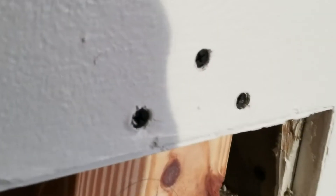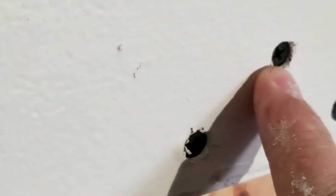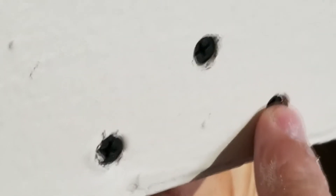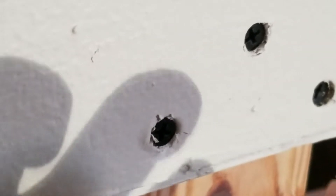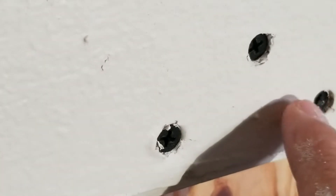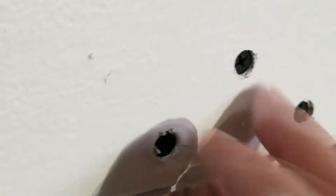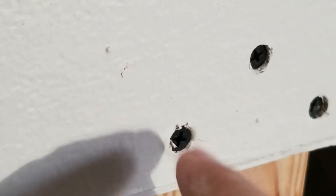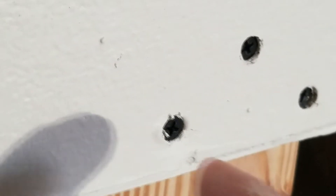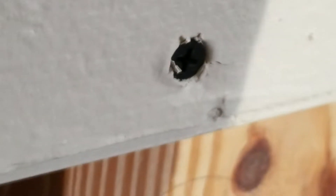Let me show you close up what the screws are supposed to do. See how I've got them just barely breaking below the surface — you just want a little bit of a dimple, no more than that. The one on the right might almost be too much, and you don't want them flush with the surface. They have to be just a little bit below so that they're pushing in on the paper. The minute you bust through the paper — if you saw white all the way around the screw — that means you've compromised your drywall and it may pop off the screws later. That's why I use an impact driver, because you'll hear it go ratcheting click-click-click just a little bit at a time. You don't want to come in with a regular electric screwdriver and go too fast and go all the way through the paper. This one right here is probably the best of the three — that's exactly how you want it to look.